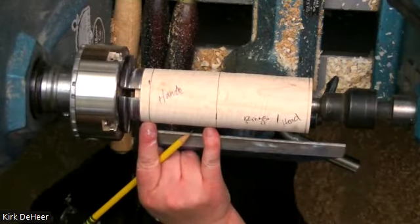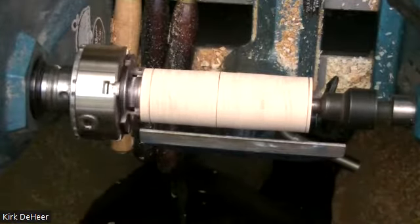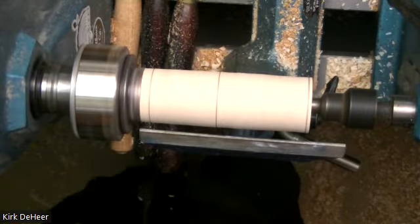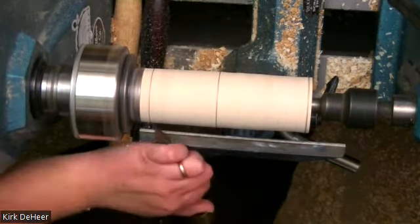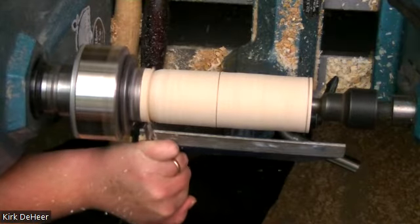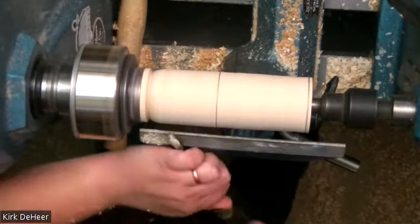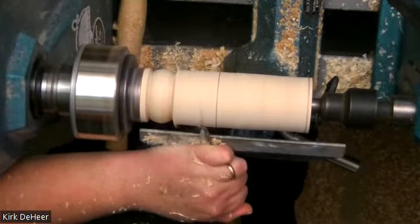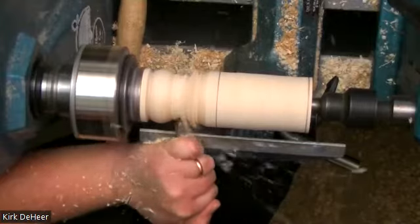This section should be about two inches approximately, and this will be the rest — you do the math. We're going to turn the lathe back on at about 1800 RPM — whatever you're comfortable with. We're going to turn a bead down the bottom. The goal for this is to just practice our beads and coves. Safety-wise for rattles, you want them to be at least as wide as the inside of a paper towel roll.